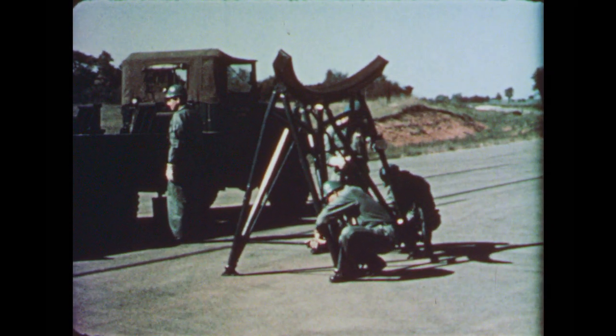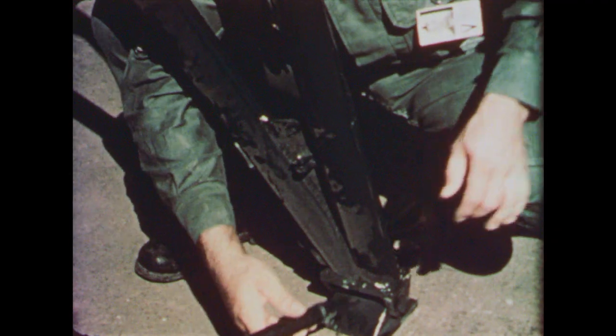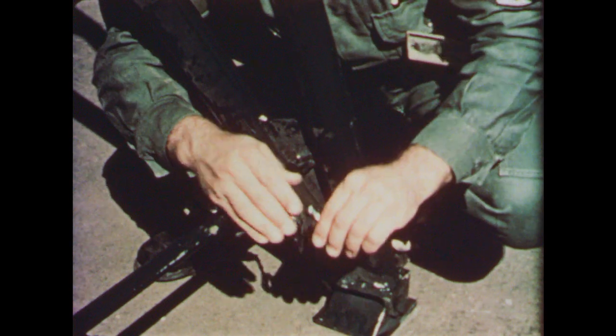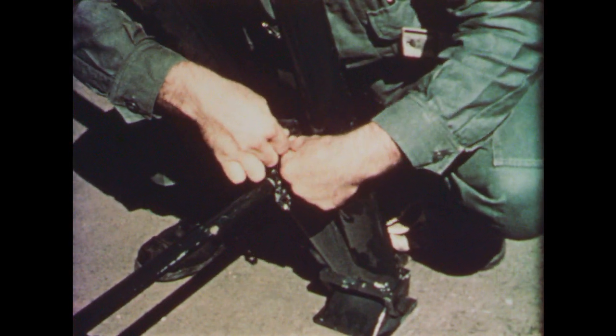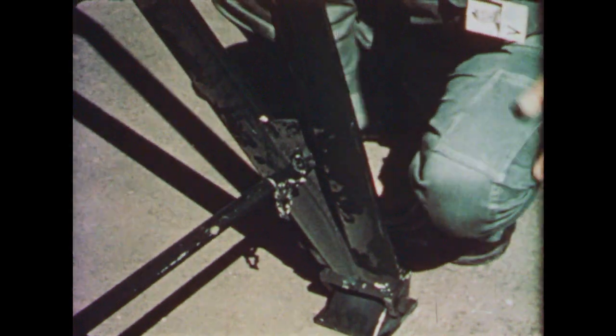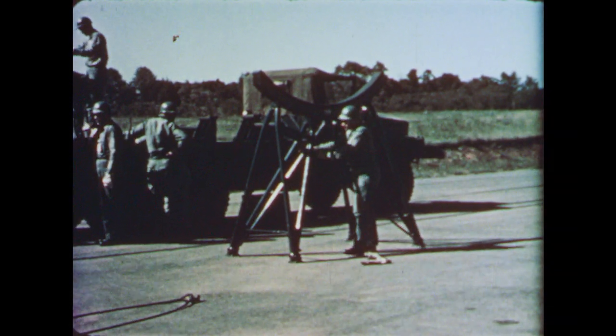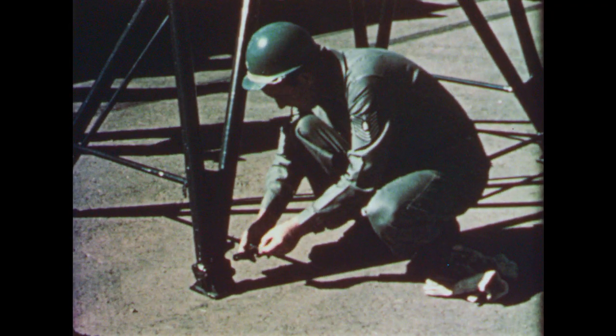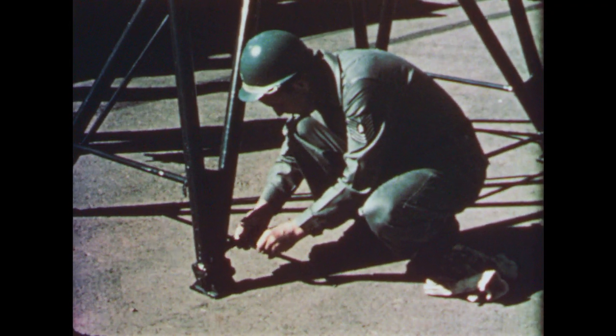A side bracket is hinged on either end of the support stand to let it swing down and across to another leg. The legs are set apart an approximate distance and the side brace dropped down. The braces are pinned to their brackets. Installing the two front braces is a similar operation. When all four braces are in place, the stand will easily support the weight of the missile. Even if heavy gloves are worn during frigid weather conditions, pinning is still comparatively easy.